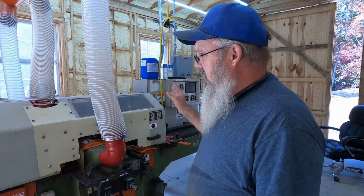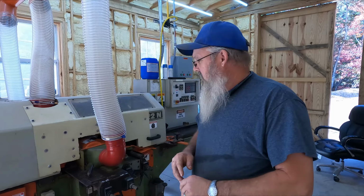There's three gear boxes on the back. Went ahead and changed the oil in those. Good thing we did. One of them was very, very low. But it's got all new, I didn't even know they made it, a 220 weight synthetic gear oil. So I had to buy a 5 gallon bucket of that, but we got it done.